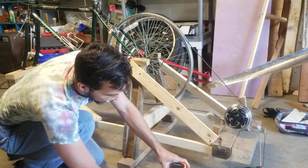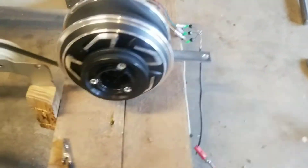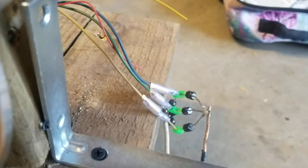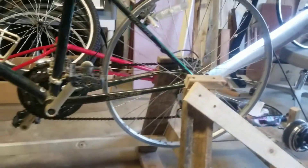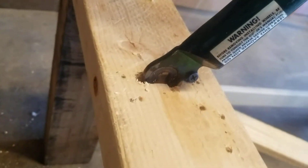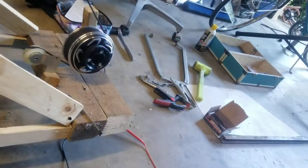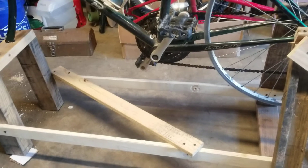Let me put this back on the volt setting. I'll give you guys a quick overview of the systems. So there's the generator with the three-phase rectifier and the diodes right there. Idler pulley. I built the whole frame just one piece at a time — I started with the back. I needed something to support the back wheel, something to support the front fork. I chiseled out some little grooves and screwed it back into this platform to get it level. Then I needed something to connect the front and the back, and something to put the motor on.